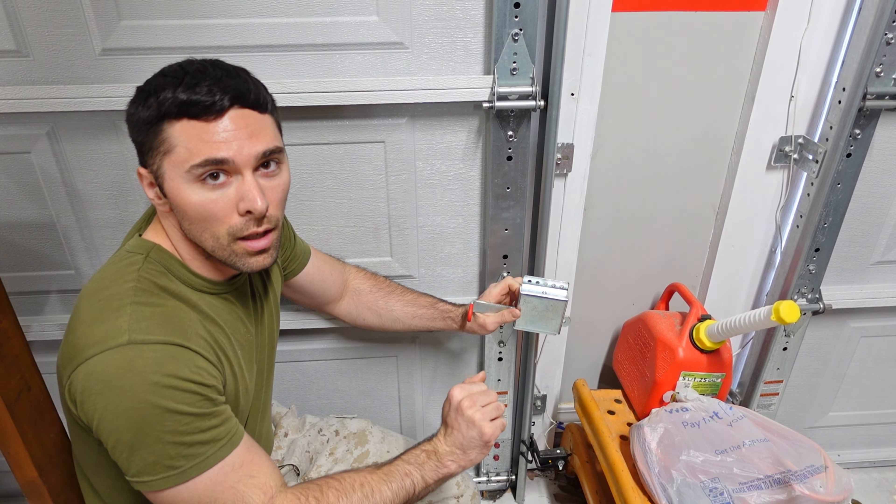So I'm using a slide lock. I have one location right here it can go into, and one more right up here. I can't use the upper one because the garage door wheel is right there — it's not going to work, and I don't have anywhere on the frame to put the mounting bracket. So I'm going to have to use the bottom one. Luckily this hole lines up well, and it should line up perfectly with the mounting holes. I will have to drill at least two more holes to secure the bracket for the top area because it does not reach up to the upper hole.